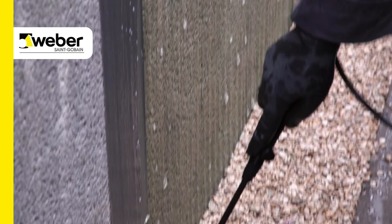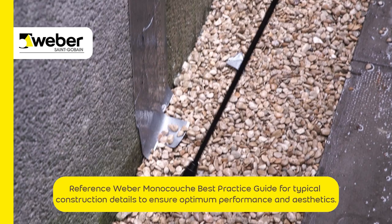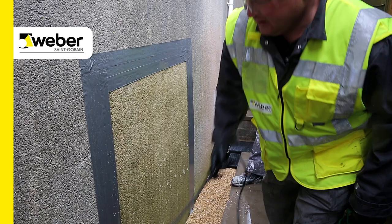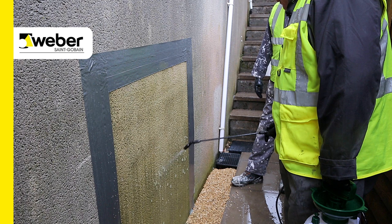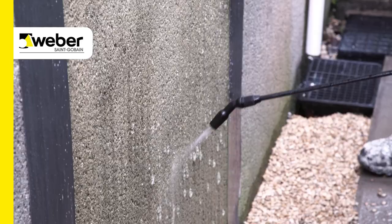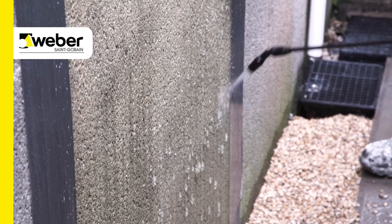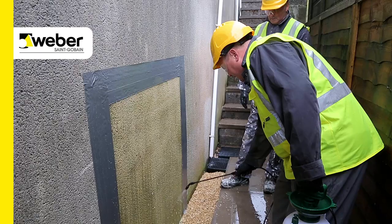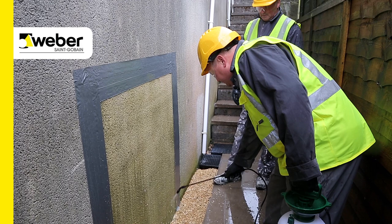What we would say is the ground level of the floor should be a minimum of 150 millimeters below, so you stop the splash point. That's why that got that stain in there — because the water is allowed to be held there. Any overhangs should have a minimum of 50 millimeters. Any verge trims on fascia boards — you should have on your soffits a minimum of 300 millimeters overhang, to allow the expulsion of the water rather than allow it to freely run down the surface.